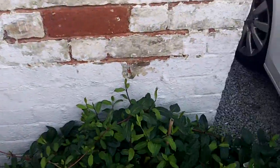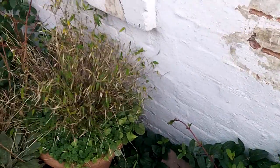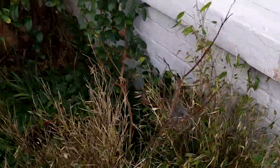There's no such thing as writing off damp — every damp issue in an old house like this has a reason, and it can be cured very simply by doing the right thing. Notice down here all sorts of vegetation trapping moisture against the base of the walls, and these are higher than the floor level inside, so we're getting a degree of penetrating damp as well.